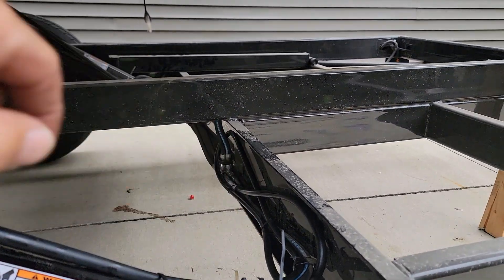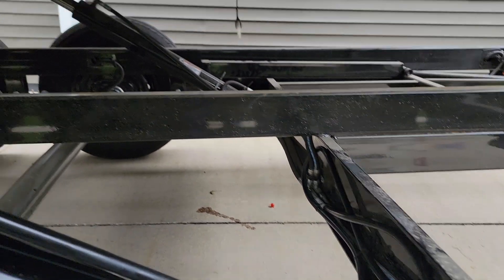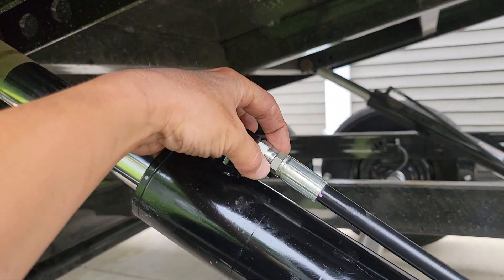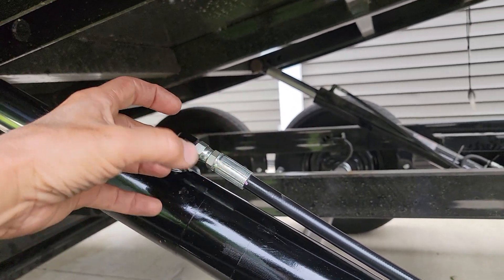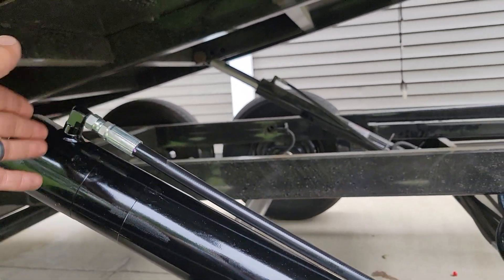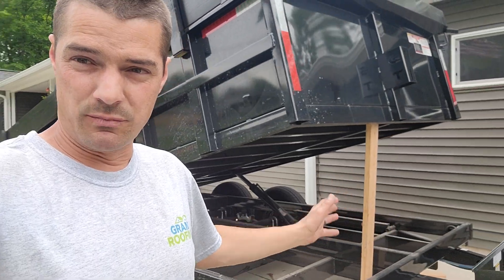Then come over and look for leaks. Make sure you don't have any leaks on this line or the other one I worked on. Once that was done, I cleaned up a bit — it's not leaking. I've been observing it for about 20 minutes. These compression fittings have a tapered end that presses in. If you have debris in there, it's scarred, or it's not tight, it could leak — and you don't want those blowing off or spewing fluid everywhere.